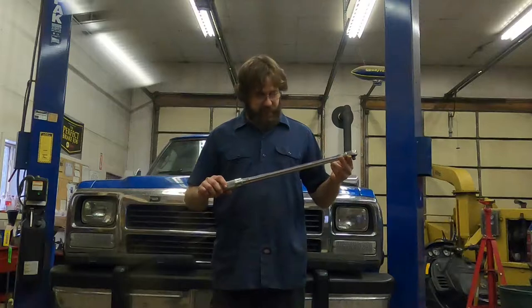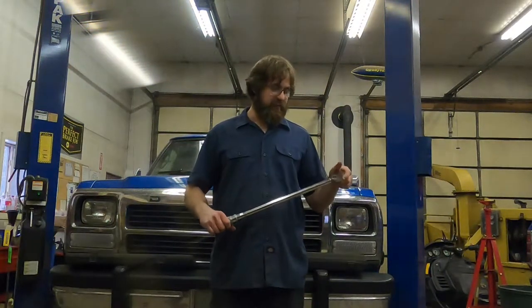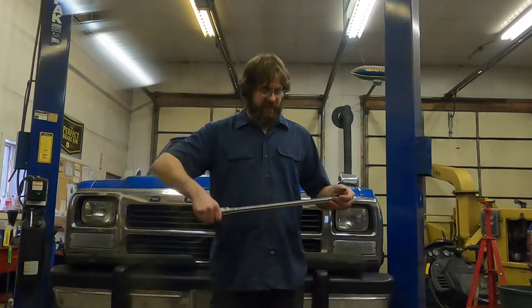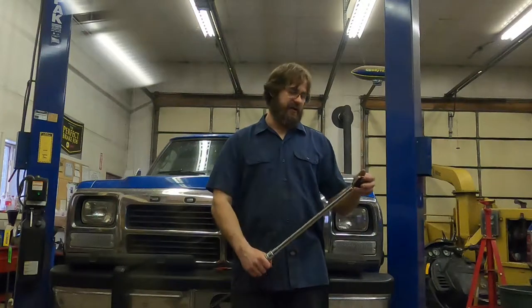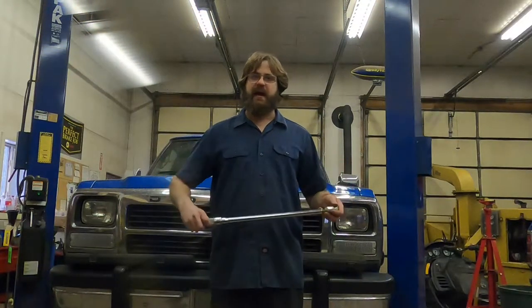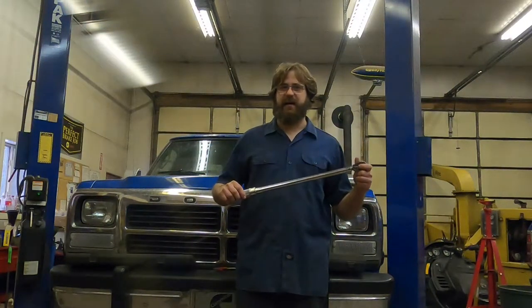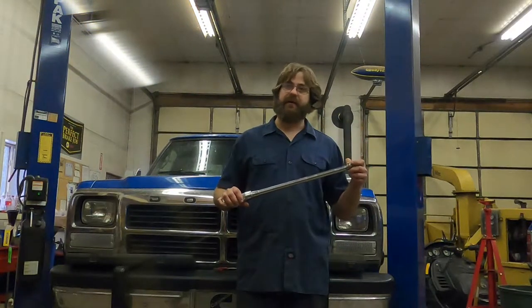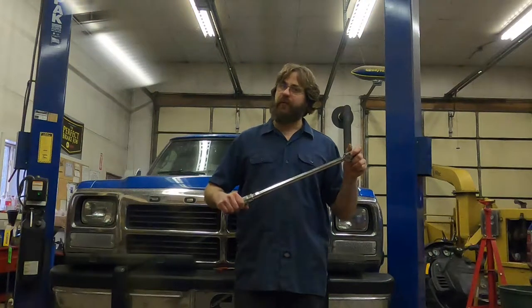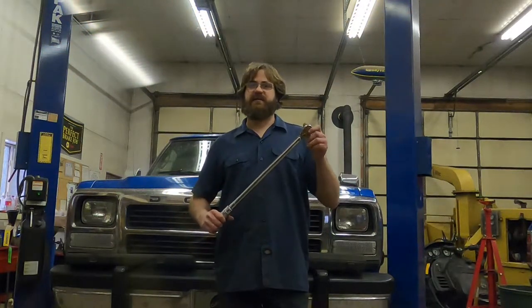This is actually the only style of torque wrench that has ever caused me to build something wrong. I had one where the calibration was off — I was setting up a pinion bearing and because it was wrong, I burnt up the pinion bearings in my own truck in a very short period of time. By doing an A-B comparison I found that the dial torque wrench I was using was off. Honestly, probably the least likely one you'll buy in the automotive world. I would probably buy a flex beam over one of these because they're cheaper and you just don't use them that often. It's really good for training because you have to be very methodical about how you're torquing to read the values.